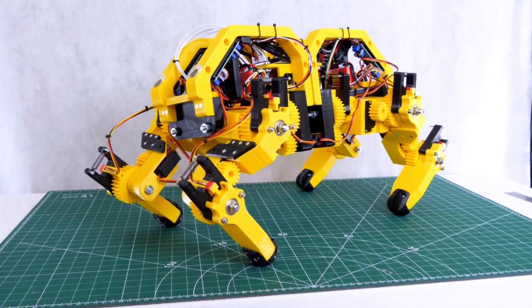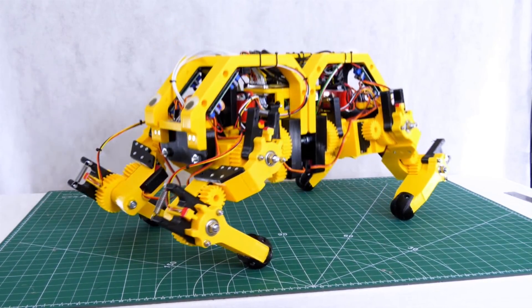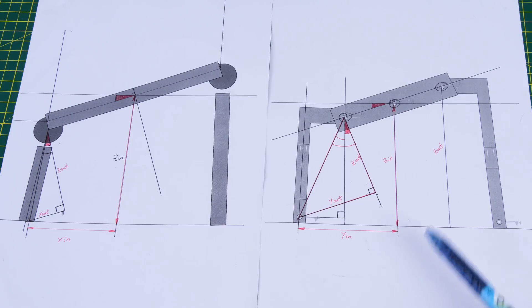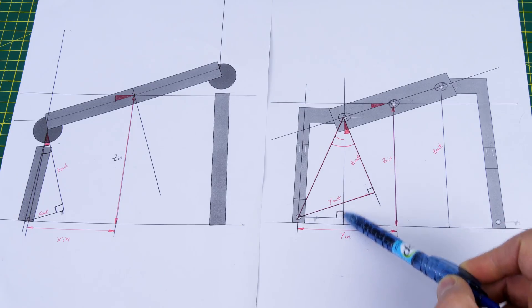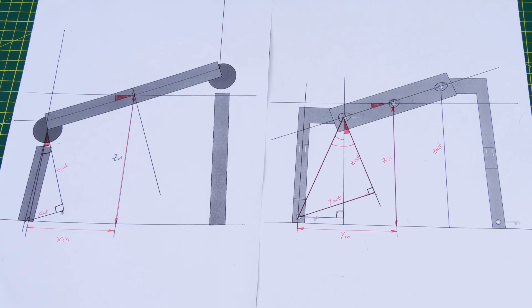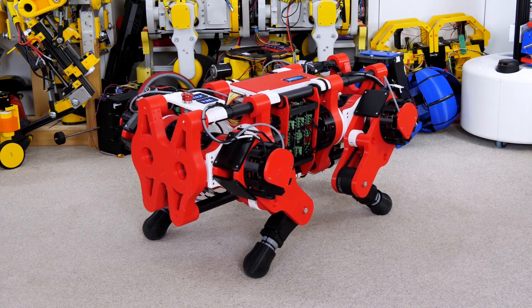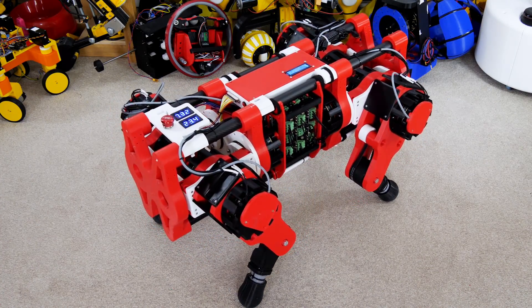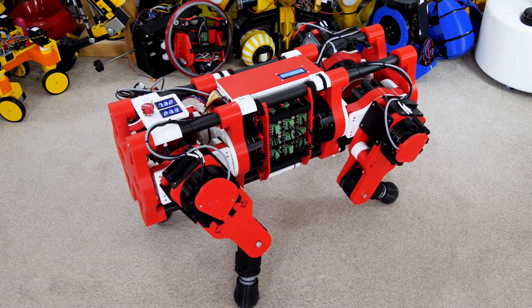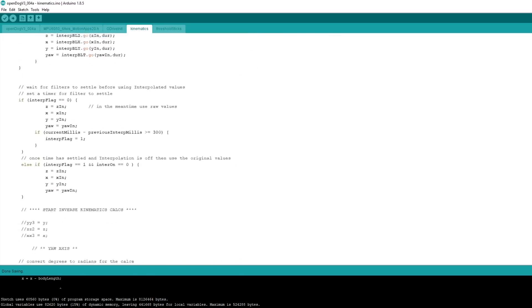There are still three axes of rotation though — pitch, roll and yaw. Yaw is required for turning on the spot but the other axes are not really required; they're nice to look at though so I've implemented them in all of my robot dogs. Calculating the rotational axes involves solving the foot positions based on the body angle for both pitch and roll. I just divided everything into triangles again and passed the values of where I want the feet to be to the three translation axes we already worked through. Yaw also works — I just worked out how the feet would move in a rotation around the central point and passed the result to the x and y coordinates of the three translation axes. All of this is written in one function which runs four times per cycle, once for each leg.